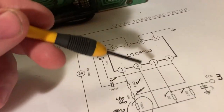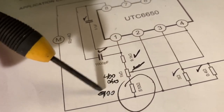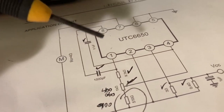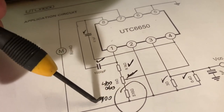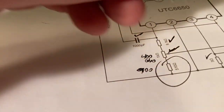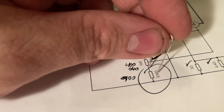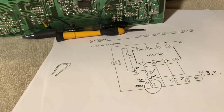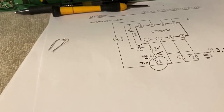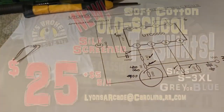I have measured some stuff, and everything seems about right except for this one. See how this says 510 ohm? When I measure it, I'm getting 900 ohm. At first I was thinking, well this schematic must just be different. But everything seems about right except that one — I'm getting 900 ohm. So I took a little jumper and shorted across it, and Tom Brokaw got real fast. My theory is: if that was 500 ohm still, I bet Tom Brokaw would sound just right. So I'm going to replace this resistor with a smaller one — try to get to 510 or 470 or something like that.